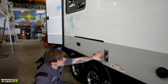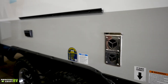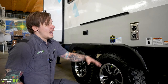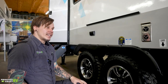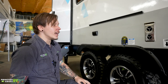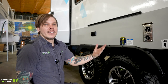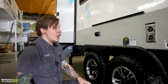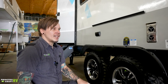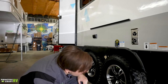Next up is our furnace exhaust vent. With any propane appliances on these campers, I strongly recommend adding bug screens. Mud daubers and flying insects are attracted to the smell of propane, and these appliances are pretty much wide open to flying insect intrusion without an added bug screen — so install those while taking delivery. Also with the exhaust vent: don't block that airflow with a lawn chair or anything while enjoying this space. It blows very hot air when on and will generally cause damage to anything in front of it.